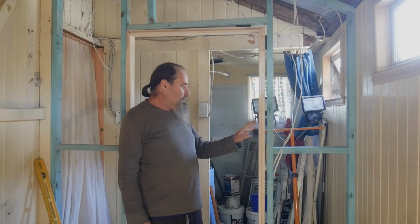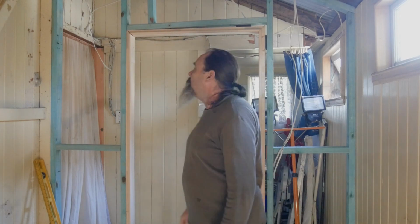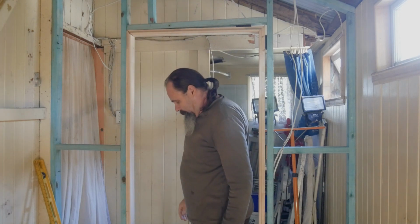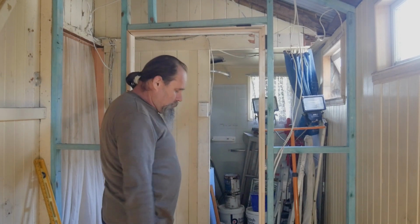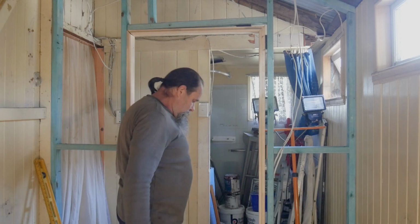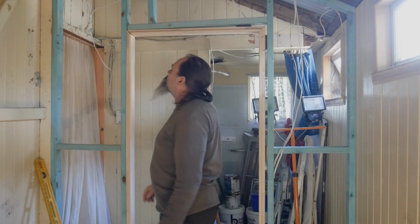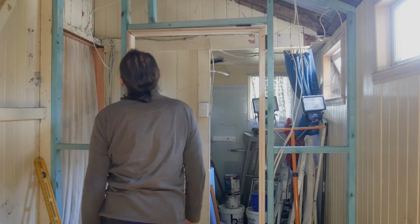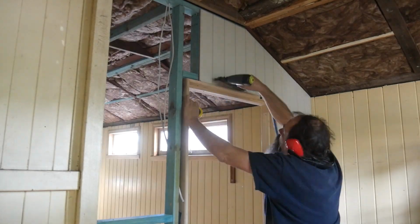Alright, we've got this second jamb up too, which was basically the same as the first, except we'd made that a little bit low. This one had plenty of height because we'd originally built the frame before we'd raised the floor up. But that was okay. We just trimmed a bit off the bottoms and it fits in there snug now. So all done. Well, that's it for this video. In the next video, because we now have jambs in place, we can line the walls and the ceilings.